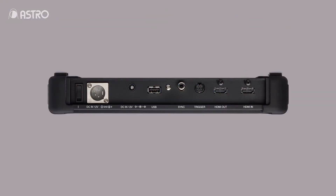Here is the top view of the analyzer. As you can see, the unit has an HDMI input and output port on the right-hand side. The analyzer supports three different testing modes: receiver, generate, and throughput mode. We also provide a USB port for logging your work, such as DDC line and CEC line communications, and any other analytical information you would like to save for troubleshooting.